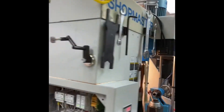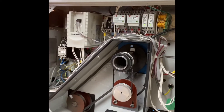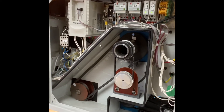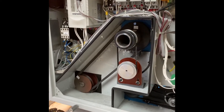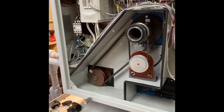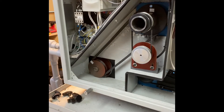Around on the other end of the machine where they had the original controls, I still have the variable frequency drive. I added encoders to the spindle, both the lathe and the mill, and this relay selects which spindle is running. If you're running the lathe mode or the mill mode, the VFD drives a different spindle motor and selects a different encoder.